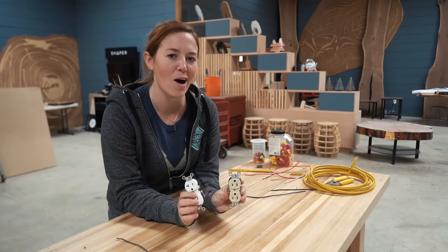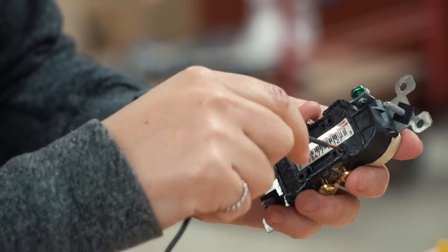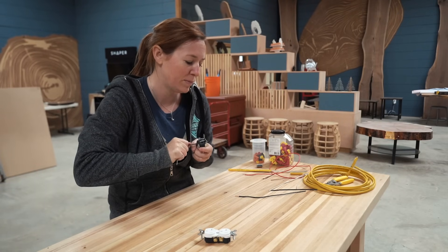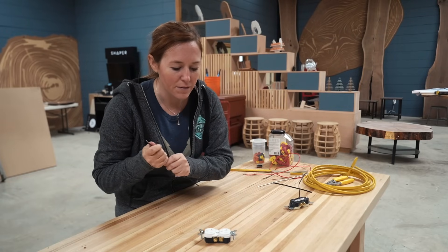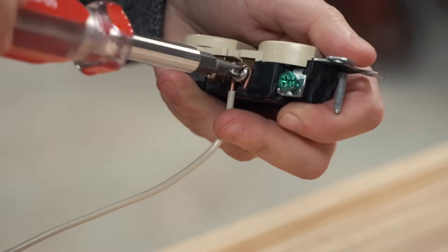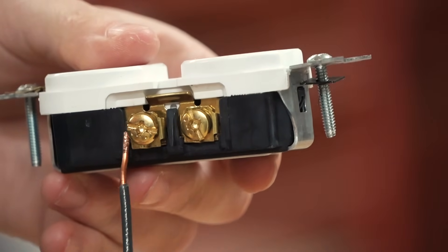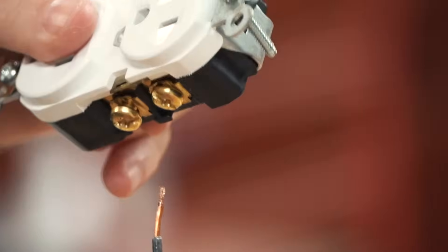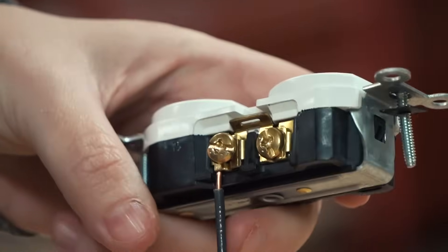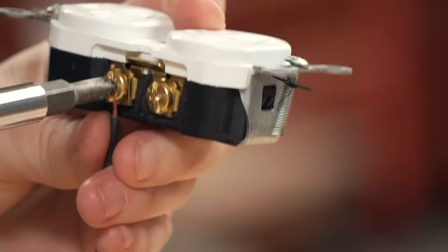When wiring an outlet, a lot of outlets come with push-in connectors on the back. Yes, they work and they save time, however, many electricians refuse to use them because they've seen so many problems with them. I definitely recommend using the screw terminals on the side. Nowadays you can get an outlet with a plate on the side that is almost just as easy — instead of making a pigtail around the screw lug, you move the plate forward, put in your exposed copper, and tighten down on the screw. Make sure you don't strip back too much insulation so copper hangs outside the terminal, but also strip back enough that the entire stab-in area is copper.